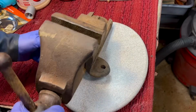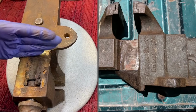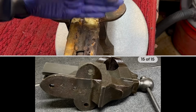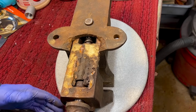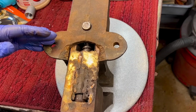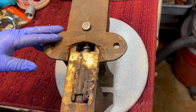When you turn this vise over, a lot of the early vises had these little edges here that were meant to go on the corner of a bench, okay? So they weren't flat, they had a little lip on the bottom. Everybody hated those lips because you couldn't mount it, you had to mount it on the edge of a bench. So that's why they did away with them. You don't see them too much today. A lot of guys used to break them off, which might have been what happened here. They might have tried to break it or whatever the case.